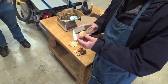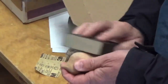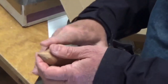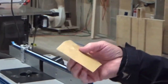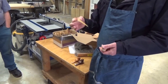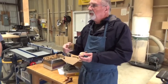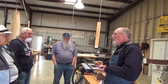For finishing, if you have your own preferred finishes that's fine, but what I use is a sanding sealer — the Zinsser sanding sealer, because it's a waxless shellac. I like that. Put on a coat, sand it 150 then 220. Another coat, sand it 220 then 320. Then I go to polyurethane and do two coats of polyurethane, sanding between the coats.